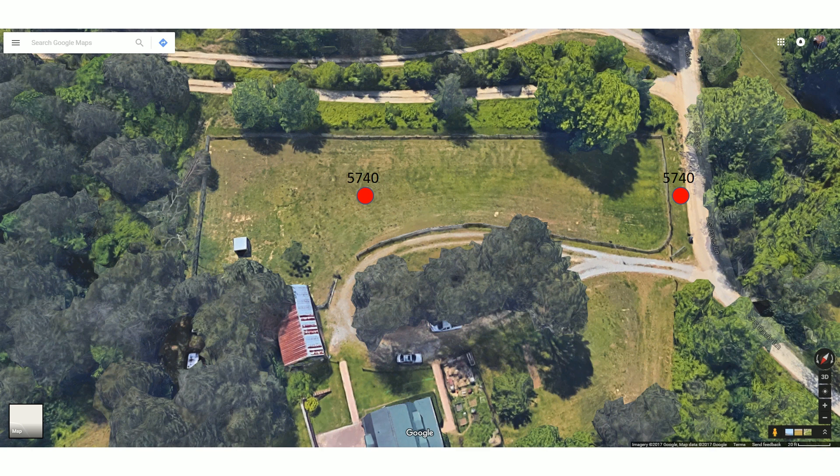Here's a satellite view of my house that I'll use to demonstrate my test procedure. I took the modules — they were in my test rig where all the modules just get plugged into a socket — with antennas down by the street. I laid out a surveyor's tape and put a copter transmitting on the same channel 200 feet away. Then I took another copter and powered it up on 5760. That's a spacing of only 20 megahertz — very, very close.